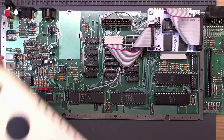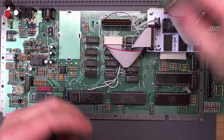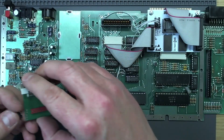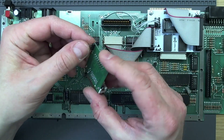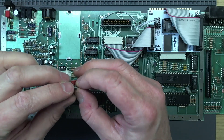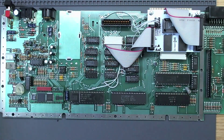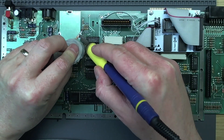The next thing I want to do, bearing in mind I've done the cutout on the back of the case, is fit the connector for the Sophia and test the DVI. I've done some measurements — the cutout to the back of the case dictates that the little 3-pin headers are going to need to give a total of a 5mm gap between the motherboard and the bottom of the adapter. Let's check the line-up properly — this one's still a bit of a tight squeeze, so I've got more solder to get rid of in this gap.